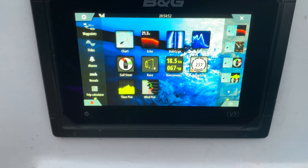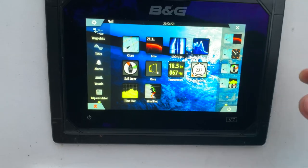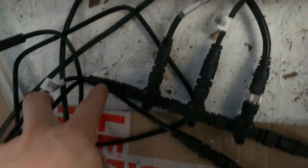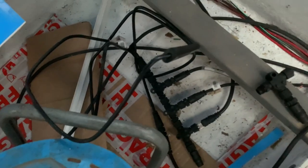We've just got to set the wind vane up on the B&G plotter. Update on the wind sensor: I've got the wires hooked up down in the NMEA backbone — it's a terminating fitting, so you actually have to have it on the end of the backbone. I'll show you where the backbone is at the minute — not its final resting place — but that's it there. You can see the wind sensor comes in at the end here as a terminator, and it has to terminate on the end. The wind sensor runs on NMEA 0183, so this is an interface which adapts that sensor to NMEA 2000 so I can run it on my chart plotter.